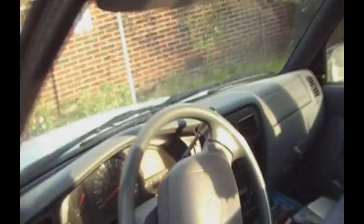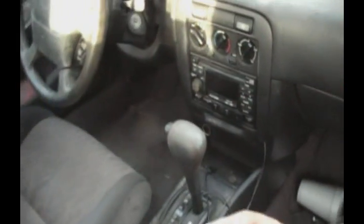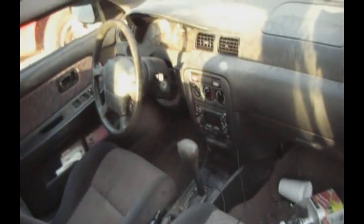This is the truck here that we're doing — a Toyota Tacoma, 98 or 99. Going in here, it's the stock radio, like a cassette slash radio. I've used this technique on this Nissan Sentra as well. We're going to try to see if it works here. The AUX input goes in through the radio tuner — on the radio there's the tuner, then it goes to the part that amplifies, and we go in between there. This should be generic and useful on a variety of radios.